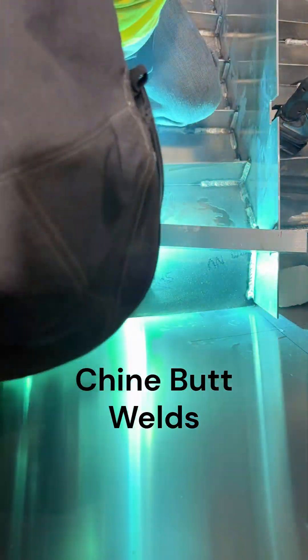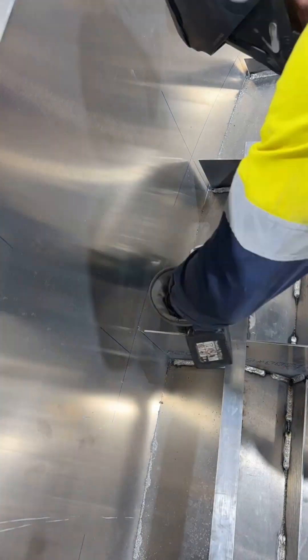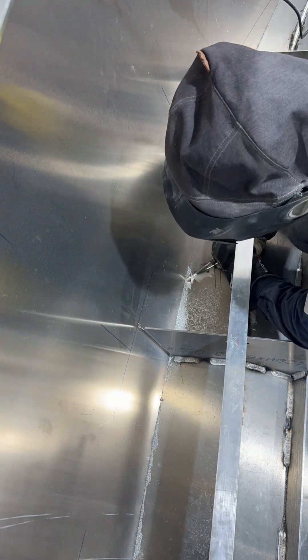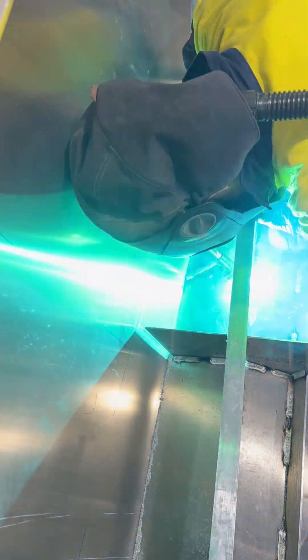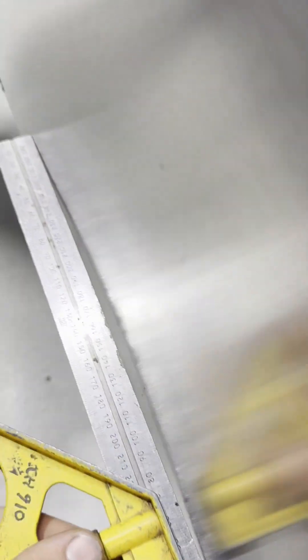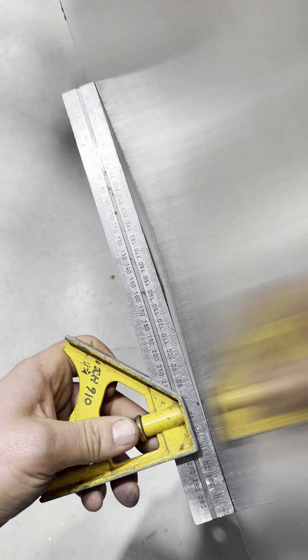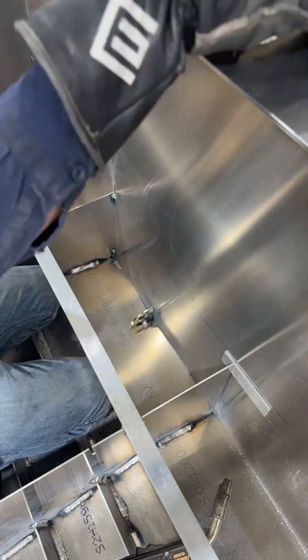There's a join in the chines — two pieces, a front half and a back half. I opened that join up a little bit and made a V into it before putting a weld in, to try and get better penetration. When I flip the boat upside down I can back-grind it after. It really pulled those chines in a bit and broke a couple of tacks. You hear it go 'ting' and then you've got to work out what broke. I was just pushing it back out with a dog and wedge to bring it back to where it was.